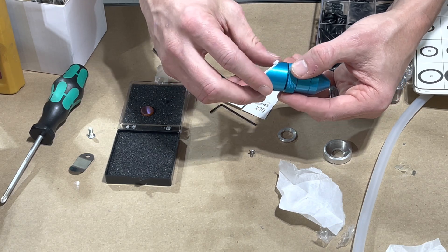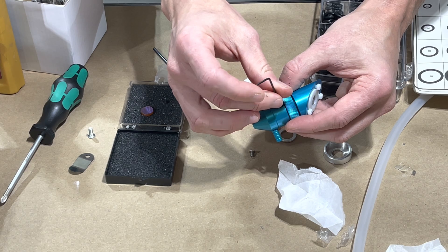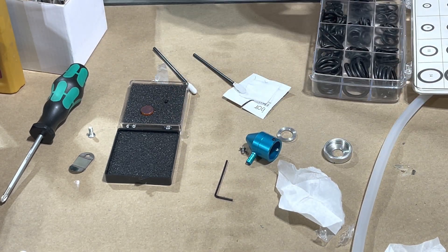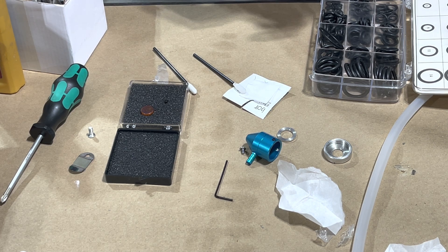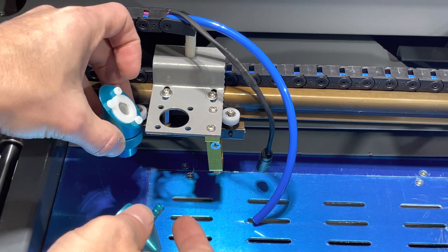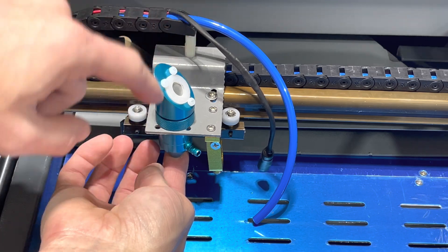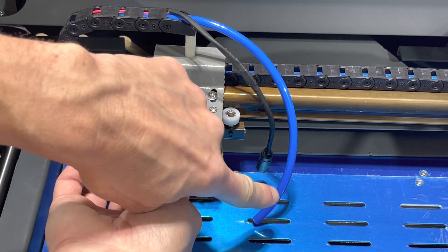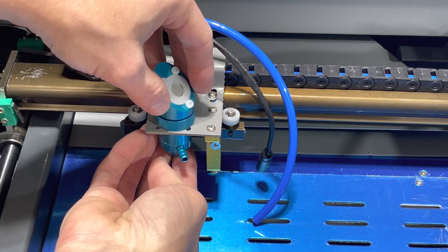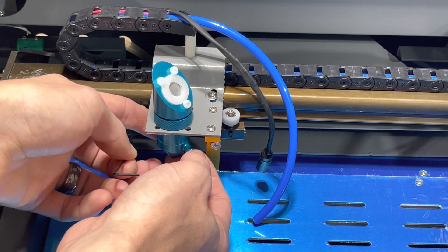Screwing the whole thing back together — we'll have to unscrew part of it when we put it back on the gantry, but this is what the assembled unit looks like. Now take the other allen screw out and the bottom barrel comes off; that allows you to adjust the air assist closer to the work piece. Looking back at the laser gantry — important note: the method I showed first is incorrect. You actually want to install it on the upper half of the laser head, not the lower half, because the lower half has no threads and won't hold securely.